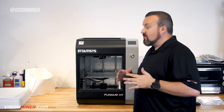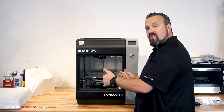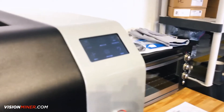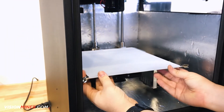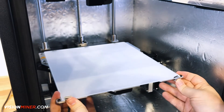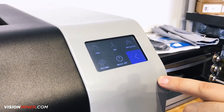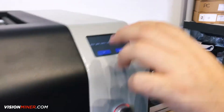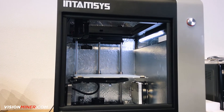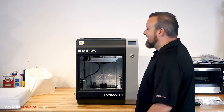Really easy, quick couple of steps to get this up and ready. Now I'm going to plug it in and turn the power switch on — it'll boot up. Put the plate glass on there, make sure it's nice and tight up against the rail, and latch it down. We'll come up to the home screen, tap on Axes, and then go to Home. It asks 'Are you sure you want to home all axes?' — yes. The Z-axis is coming up and it's going to hit the limit switch to home it. Perfect.